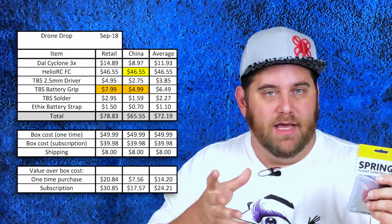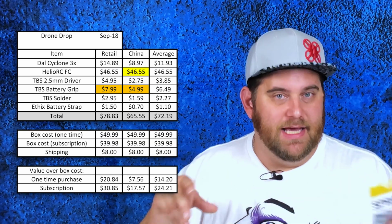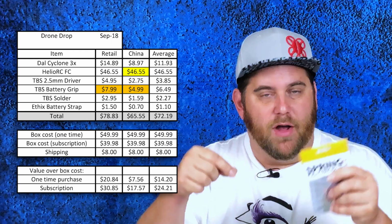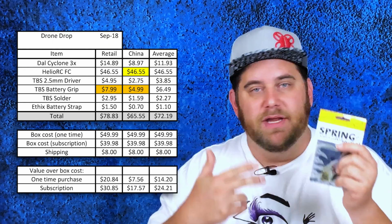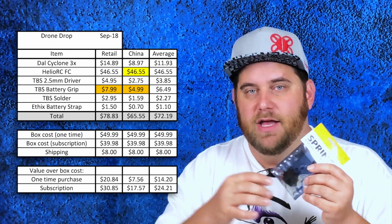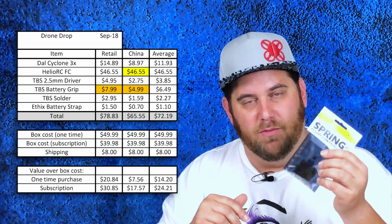However, normally when you're building a quad, your power has to go to a power distribution board, which sends it to each of the ESCs, and then the flight controller you hook up your signal wires to tells the ESCs what to do with that power. You don't need that extra layer of a power distribution board with this one. It's built right in. Your ESCs will hook up directly to this board with both their power wires and their motor signal wire. So that's a pretty cool thing.